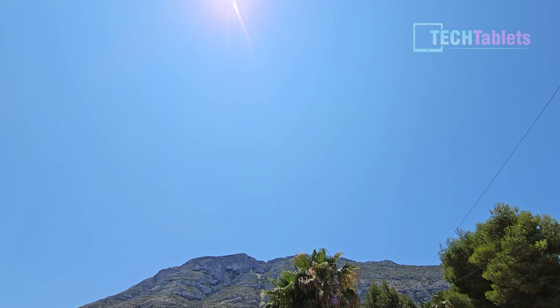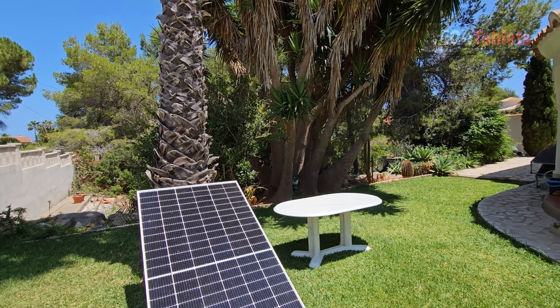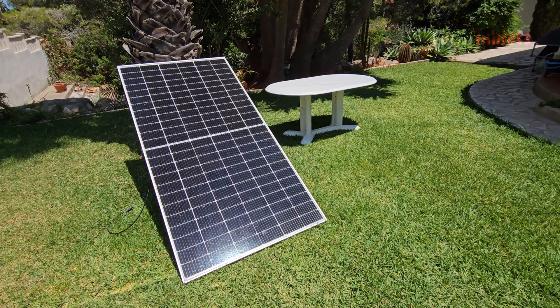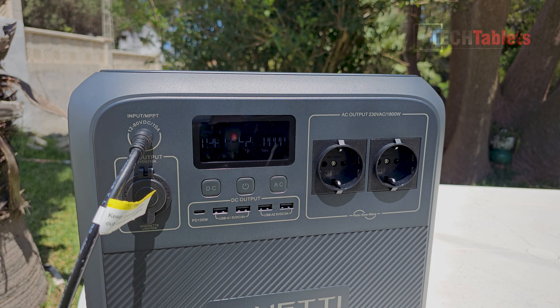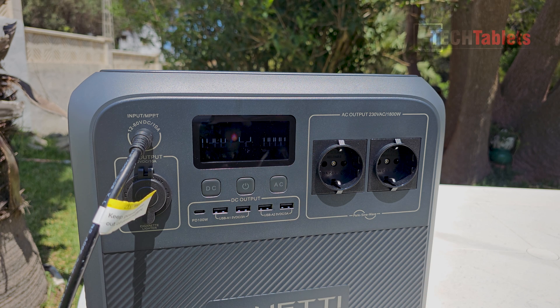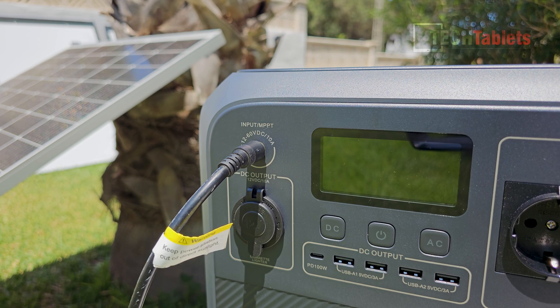It's 2 p.m. with the sun right overhead — perfect conditions to test the solar input on the AC180. My test solar panel is rated at 450 watts, with the best output I've ever seen being about 409 watts. Just keep in mind: don't charge it in direct sun as the BMS temperature sensors will eventually power it off as a safety precaution. Right now I'm seeing 368 watts at 52% charge, with about 1.5 to 1.6 hours left to fully charge. The solar input maxes out at 500 watts, so don't exceed that.